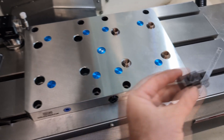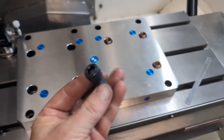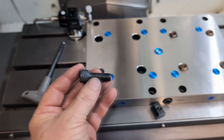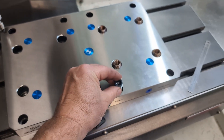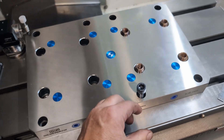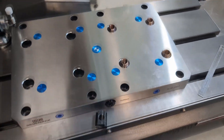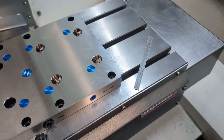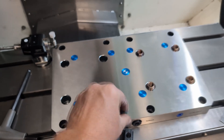All of my T-nuts are this size — they register in the T-slot very well — and here's the hardware, nice and robust. Unfortunately, this is slightly larger than 10 millimeters, and it looks like the diameter of these holes is exactly 10, so none of my screws are going to go in. I need to get new T-nuts that fit these slots with hardware that fits these holes. I think I'll wait for SilverCNC to get back to me and see what they recommend. I might fab up my own, or if you guys have any ideas, let me know in the comments.